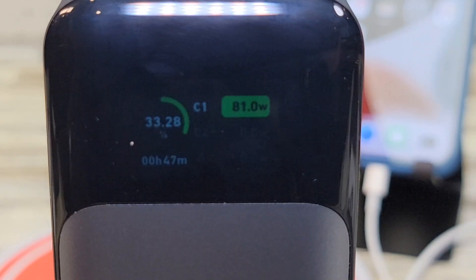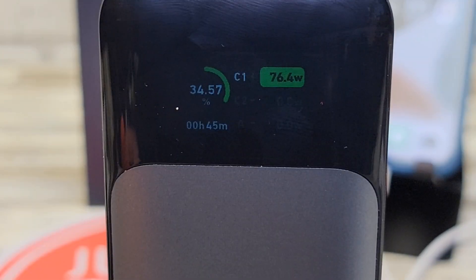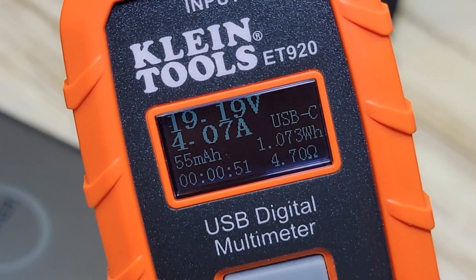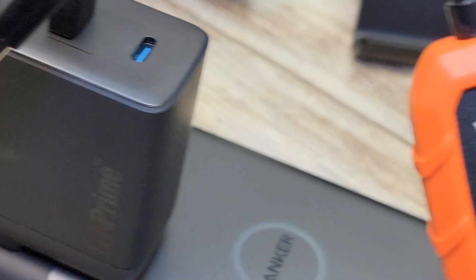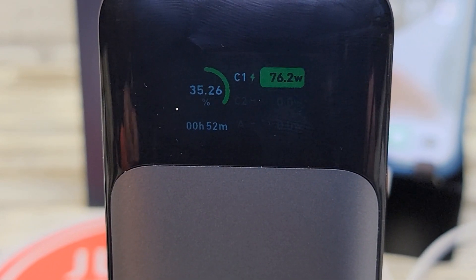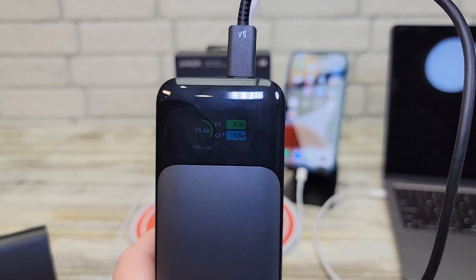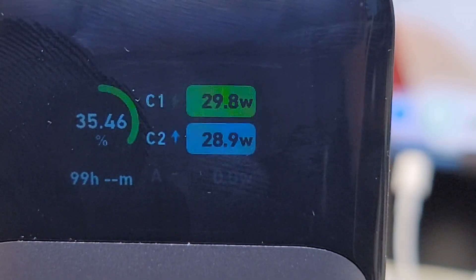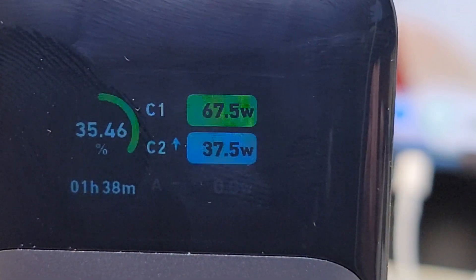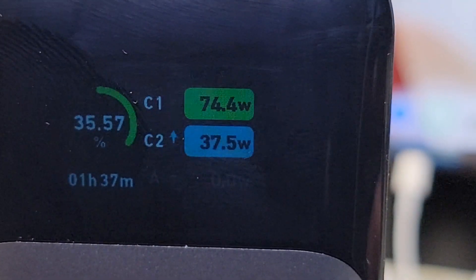Let's charge it. You can see how the display changes to green to show it's being charged, and there's a little charging symbol. I've got the charger hooked up — it says it's charging at 76 watts. I've got my Klein Tools meter, and it shows 19.2 volts going out of the charger at 4 amps, which is 76 watts. So it is displaying accurately how many watts are going into the battery. I'm also charging the MacBook Air on this one while charging the battery. The MacBook shows it's charging at 90 watts, though this display is only showing 37 watts.